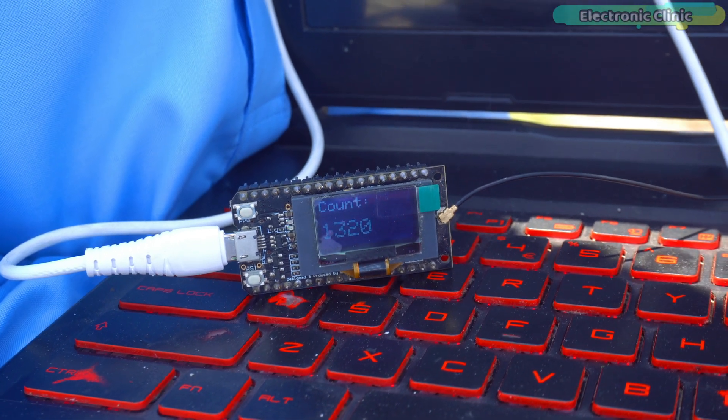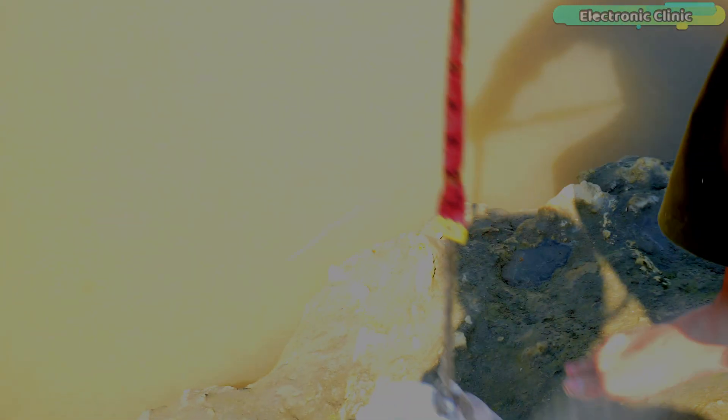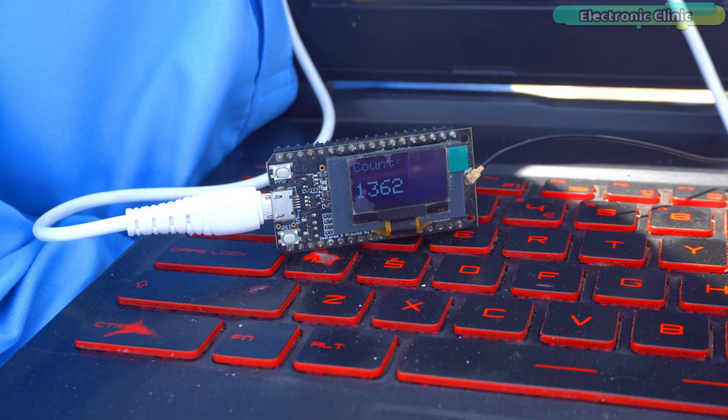Let's see if 866MHz can handle the pressure — everything looks just fine. Let's start the test. The counting has stopped on the receiver. 2.9 feet is the maximum depth from where the 866MHz LoRa transmitter can effectively communicate.